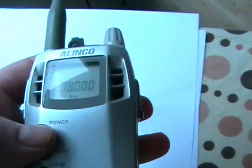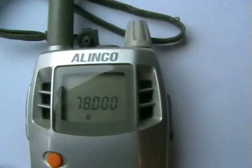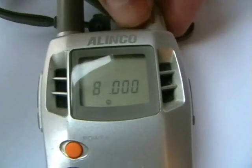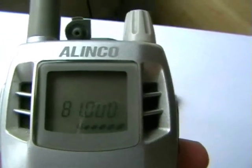You can use a standard FM radio to pick these little crystals up. The sound won't be brilliant — it's only a very simple construction. So here's my scanner. The crystals are 27 megahertz, so we should get a sound output on 54, 81, and 108. There you go — that sounds a bit. 81 megahertz. There you go.